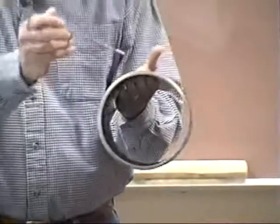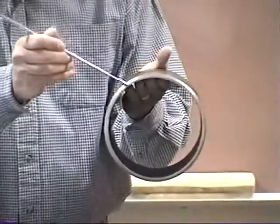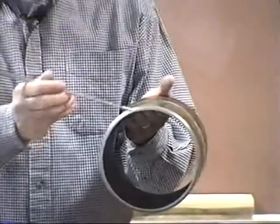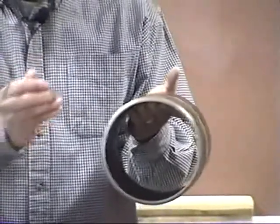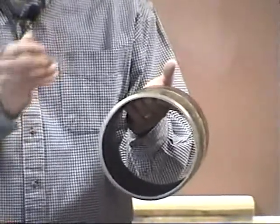With your hot pass, you're going to be whipping it in there using that whip that we've already learned in previous classes. What that does is it pushes that weld puddle up and makes it flow into the sides. You're also going to have a slight pause on the top side. Pause, pause, pause. Not much, but a little. And your whip is only going to be about 1 1/2 times the diameter of the electrode. You're barely going to clear that puddle.